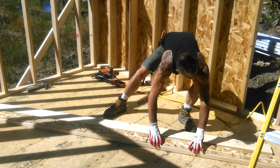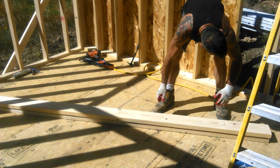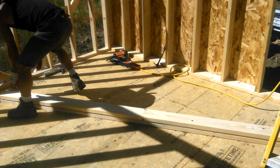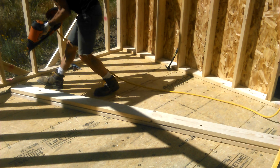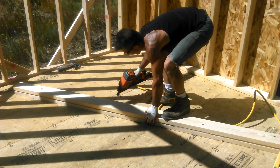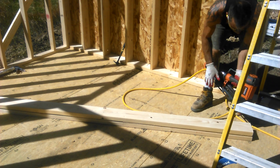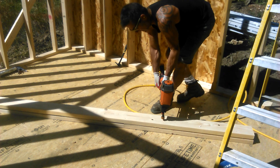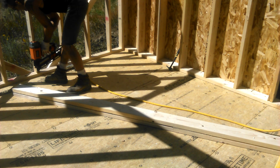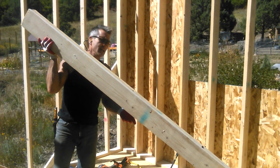Looks nice — make sure it's all centered. When you nail this, you want to make sure it's not overlapping here because that's just more work. I'm just putting some set nails in here. And there's your glue lam. Now I have a huge beam that will hold weight. Instead of paying $5 a foot for this, it's probably half the price.